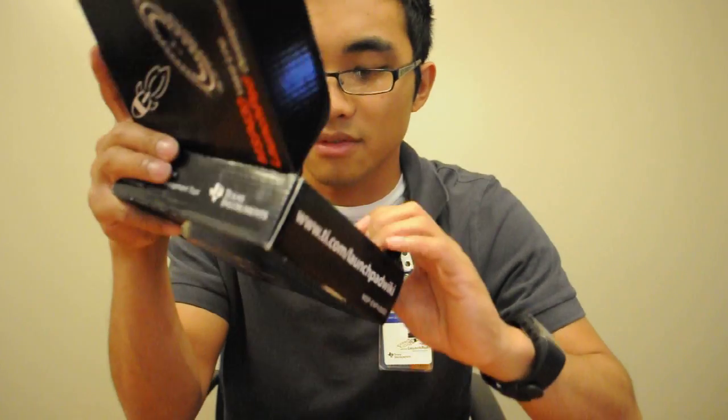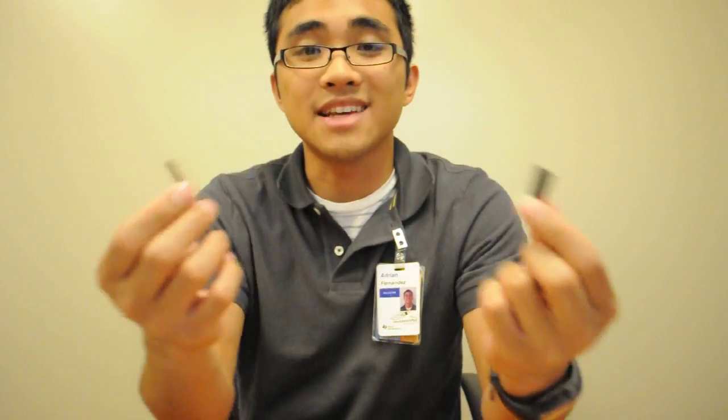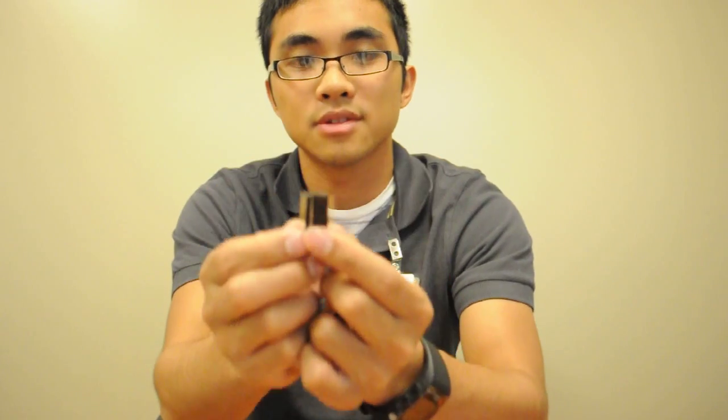Also within the flap, you've got 10-pin PCB connectors. We provide two pairs — a pair of male headers as well as a pair of female headers. They have 0.1 spacing between the pins, very standard size. This allows you to easily interface external components with the Launchpad, or even plug in custom daughter cards to expand the functionality of the Launchpad board.